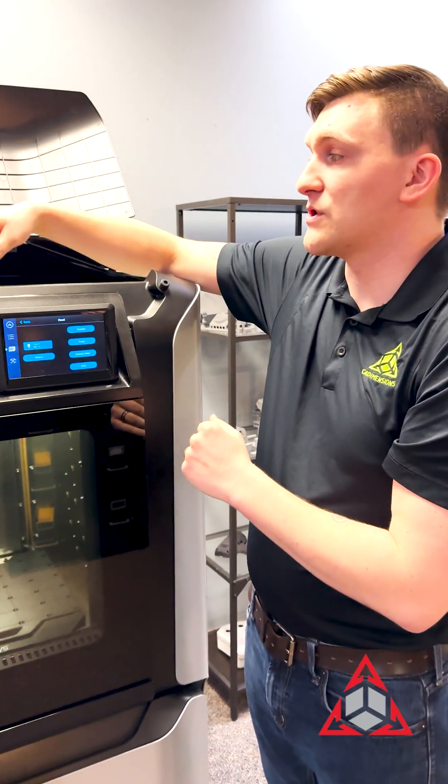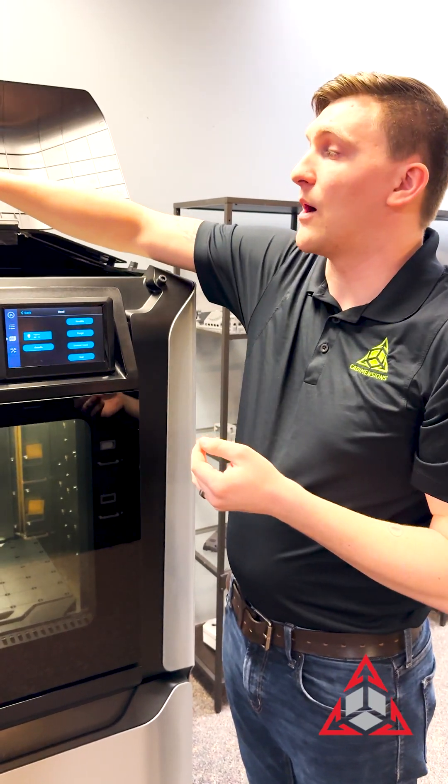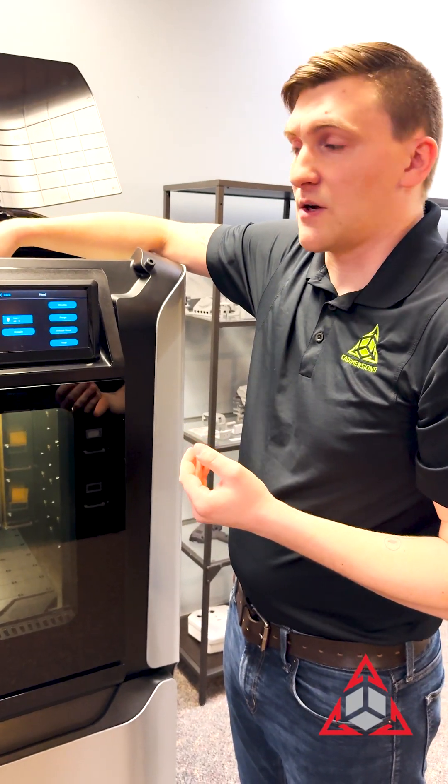The only note being that once you're in this mode with the lid open and safeties disengaged, you do not want to unplug the ribbon cable on either head — that has a chance to short the head, ruining it. Though not always, so just be careful of that.